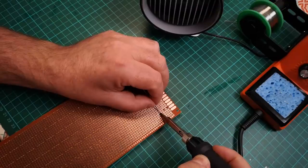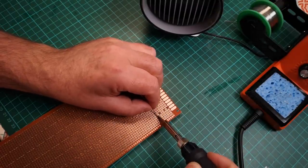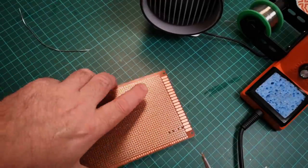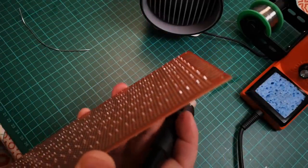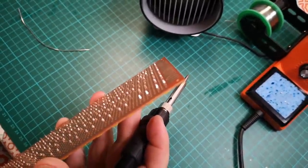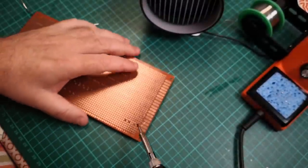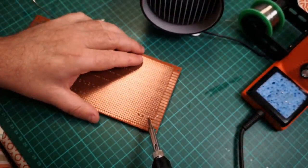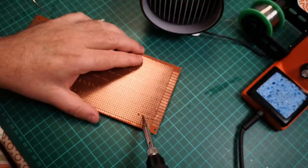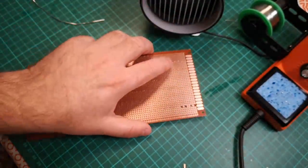Yeah, that'll do. This is just going to be a laborious job of soldering in all these little pins. Not really very sure that I've made those good solder joints. Let's have a look. Rate my soldering. Might need to actually just heat those a little bit more to flow them down onto the pads, but I've got to be careful. It doesn't really matter because I'm not using these pads as such. I'm going to solder wires to these, so as long as they're mechanically held in place, they're going to be fine.